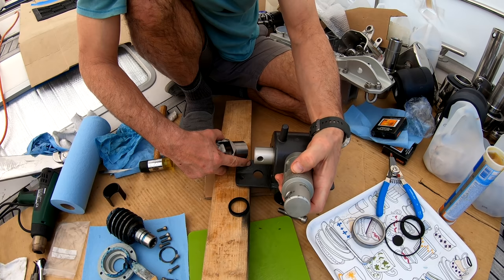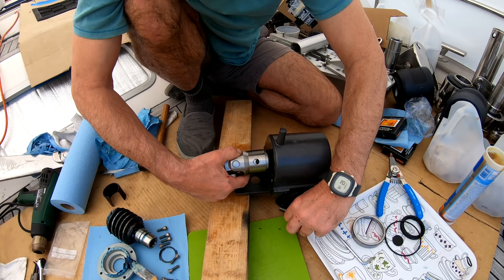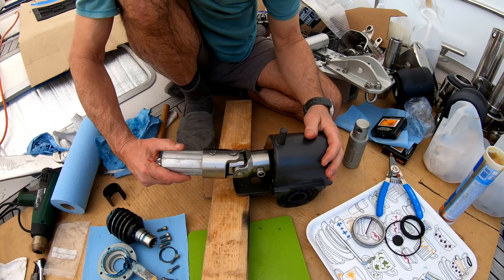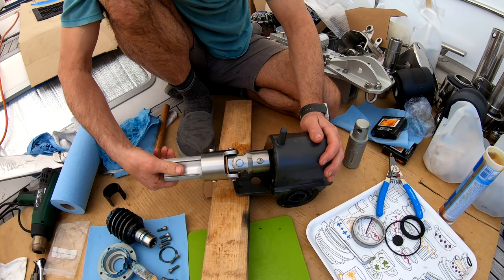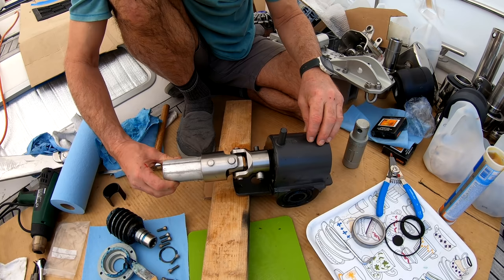So this time I'm going to put this 40mm V-ring on there. I just wanted to check with a dry run, dry before I grease everything up, that it fits. Now just bear in mind, this isn't Formula One, this is going to be turning pretty slowly and not very often, so it's not going to get hot or anything. And that looks like it makes a very good seal there now for any water that comes down on top, which previously just used to go inside. So I think that should be quite an improvement.